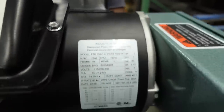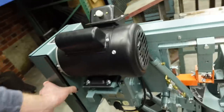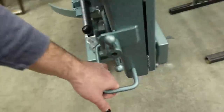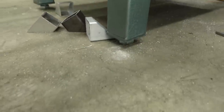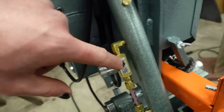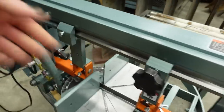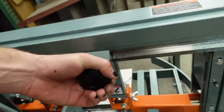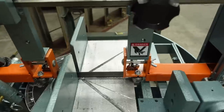The motor is still a bit of a mystery. Over here we have a three-speed gearbox — it's on the fastest speed now, and you can slow it down for whatever material you're cutting. There's a nice pull-out handle so you can move the saw around. It has leveling feet — two big bolts under here that screw in and out to level the machine. Parker brand hydraulic fittings. And of course, moveable blade guides — move them in or out depending on what you're cutting, to make sure the blade is nice and square.